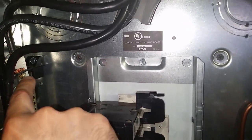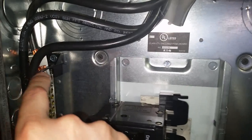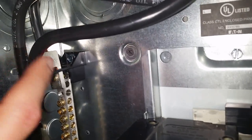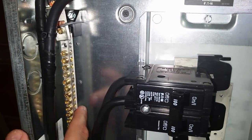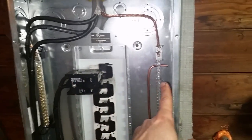The neutral bar in the sub panel was previously connected to the ground bar — which is wrong. The neutral bar must always be isolated from both the case and the ground bar. I removed the connecting strap. You can see the neutral bar has plastic standoffs mounting it to the case, isolating it. This panel also came with a green screw and a strap near the neutral bar — always remove the green screw from a sub panel. The correct configuration is: neutral isolated, ground bonded to the case.